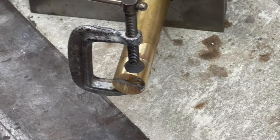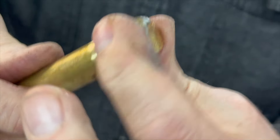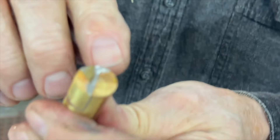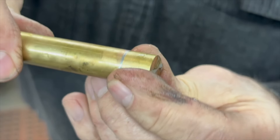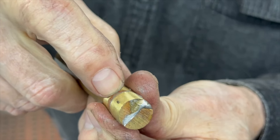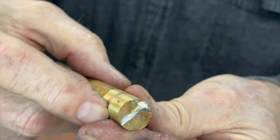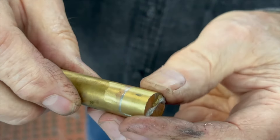Okay, that's good. Now as you can see, it's a nice soldering job and it's tight this way. That's the really important thing. If it was a little off the other way, it wouldn't matter because you're going to turn this down — this should be a little oversized from your final finish. It has to be soldered here to give it strength. But if you get a good faced piece and a nice clean cut and push it together, it should be fine.